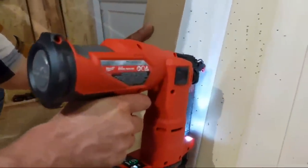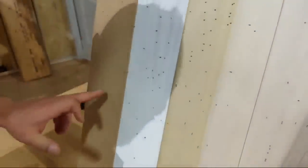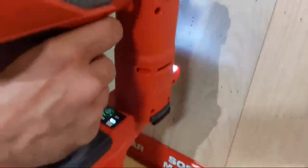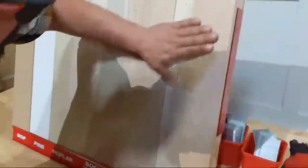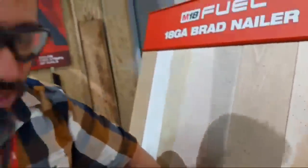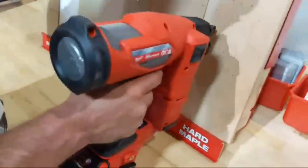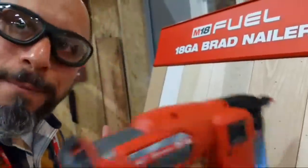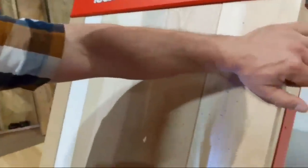No problem at all. Look. MDF, pine, and poplar all set perfectly. We'll go into soft maple, then red oak and hard maple. No problem with any of them. Now, you might see a nail that needs to be set here, but a lot of guys are coming up here and they're not pressing the nail gun down. They're rapidly firing nails. They're not setting the nail gun.